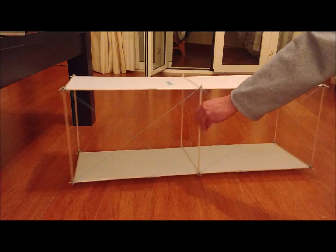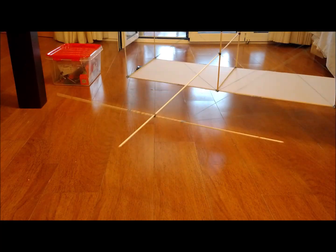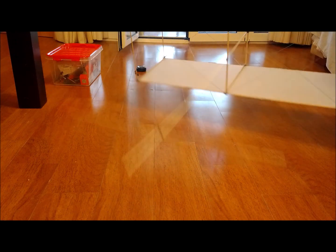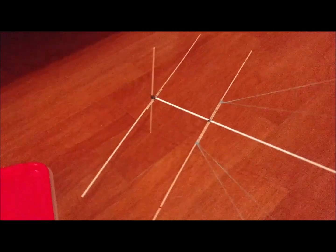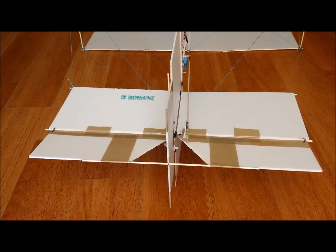The weight of these wings is 95g. For the fuselage, we use a 4mm diameter fiberglass rod, bought in a curtain shop. These rods are usually used to mount the folding blinds. They are sold at a price of about 40 cents per meter. These rods have a linear density of 23.5g per meter. Our rod has a length of 123cm. The buckling of the rod is suppressed by anchoring it to the wings using threads.